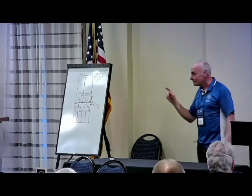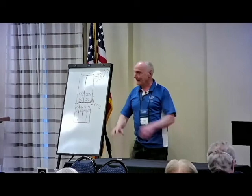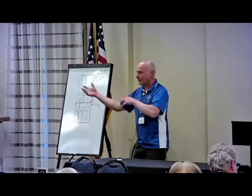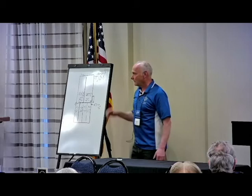Okay, with oil, to be honest, it's harder to have steady heat with oil than it is with wood. With oil, we get a hot spot right there where the fireball is. Everything else is cooler. And with oil heat, we reflect that heat to the spots that don't have the fireball. So your arch is configured so it's reflecting that heat even to these corners that are hard to get heat to.